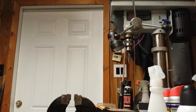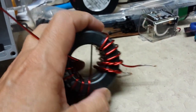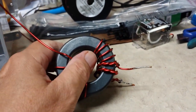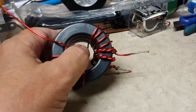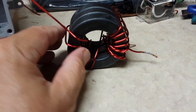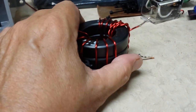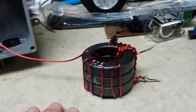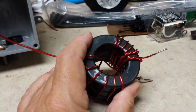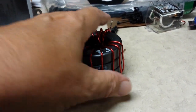We are ready to wind. I got the core wrapped. Here we have the primary, which is two turns twisted, and we go seven turns this way, then cross — you count the cross as turn number eight — and then nine, ten, eleven, twelve, thirteen. So with three cores, we use thirteen turns instead of fourteen, like we do on the two-core and the one-core. I have found that thirteen on the secondary gives me lower SWRs. And again, this is 52-type material.